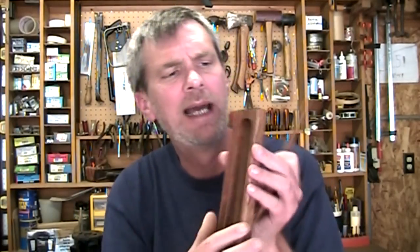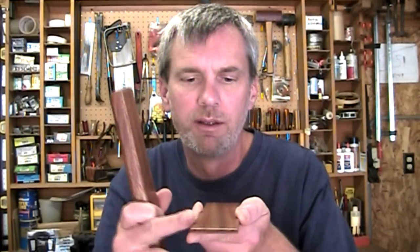There are a lot of different ways you can make this box. You could certainly use the bandsaw for most of the cuts. I was trying to avoid that entry point because I didn't want to have to glue it back together and create maybe an out-of-square box. I'm not so sure that's so important — in retrospect you could probably use the bandsaw. I originally was going to cut out the center part using a straight bit on my router, but I found I couldn't do that because I wanted the deeper box and the router bit wouldn't go deep enough. You probably don't really need to use a scroll saw even — you could cut out the center part with a handsaw. The key technique is that dovetail on the sides that creates that little slide.